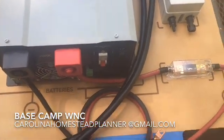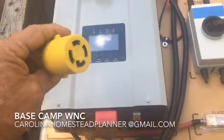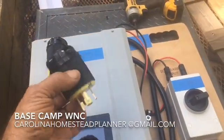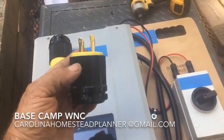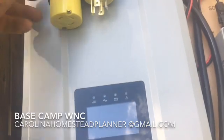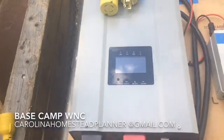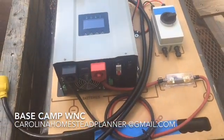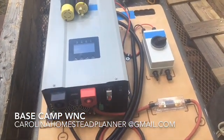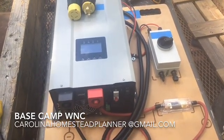You have one cable here — this is the outflow. They even send you the cable you'd wire onto your well, and it just plugs in. The other cable plugs into a wall socket for 220 grid power. If you don't have grid power, just leave that breaker off. Or you can hook up to it — here in western North Carolina, let's say you made a mistake and put your solar panels on the roof and it snowed two feet.